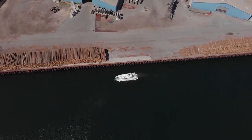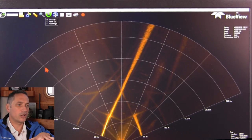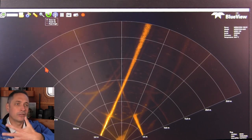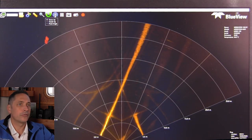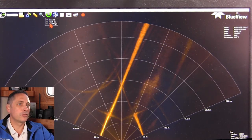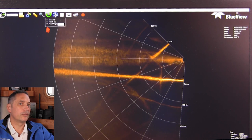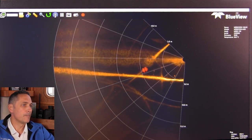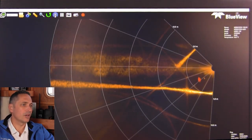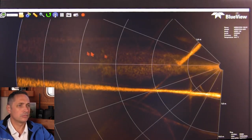What we did is take the sonar and instead of having it in the usual 2D forward-looking horizontal orientation, we flipped the sonar. Because we've got it on a tilt offset, I can't offset it by exactly 90 degrees. I fiddled with it and got the angle right — I put in a fixed angle of minus 110, which makes the seabed appear flat. As we go along the side of the quay, we'll be able to see some quayside scans.